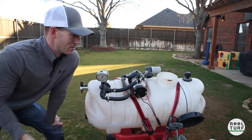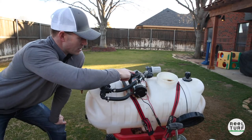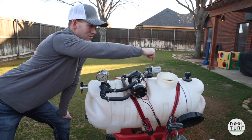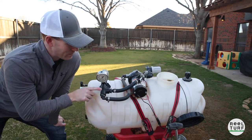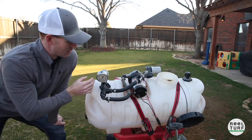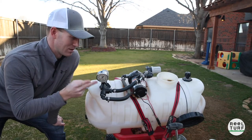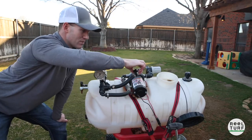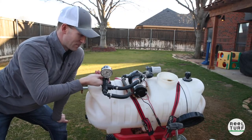When you get down to the backflow regulator, you adjust your pressure on the back side of the regulator and your pressure rises on your pressure gauge — that's how you know how much psi you're putting out on your jets. The way I was able to prove this is working: when we come off the pump on the high pressure side, your inlet sides are back here, water comes through the pump, comes to your high pressure side, then into a tee right here before going to your jets. This area right here is where the pressure is applied.